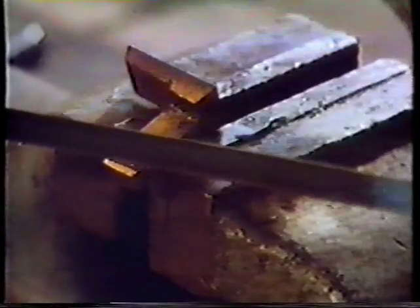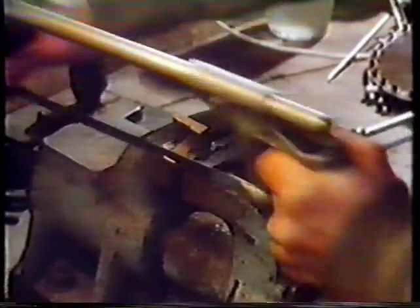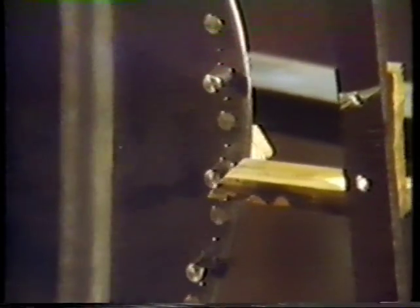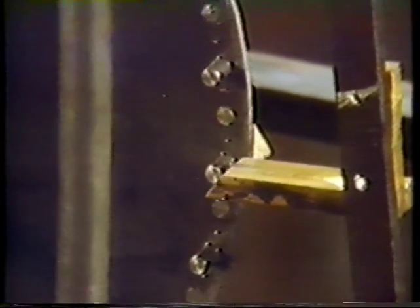The next day he made the brass pallets — much nicer stuff to work with than nylon, and much more rigid; it felt a much better job. But then the thing didn't work at all, and he couldn't think what he'd done. In fact the problem was in the bearings — he found that by tapping the mechanism he managed to get them in line, and then the thing worked much better. That day he was feeling quite pleased with himself.